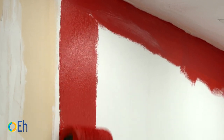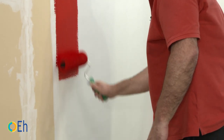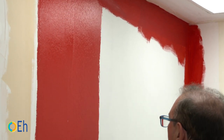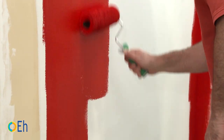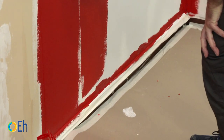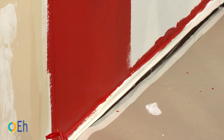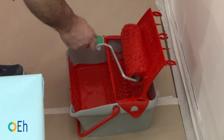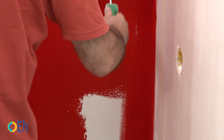Despite loading a lot of paint, I can extend it for a very long time. With a paint like this one with high hiding power, we've made a lot of progress. Matte paints usually cover more than satin ones when painting because they have a lot of pigment. At the same time, this forces us to distribute the amount of paint very well because otherwise there may be marks left from the roller. They are very porous, very breathable paints. If we need a wall to be breathable because there is any presence of moisture, it will always be better to use matte paint. Even if a paint covers better the bases, I am always in favor of applying a second layer, even if the first layer looks okay. This way, I am guaranteed to have the wall more protected and it's going to give me more duration.